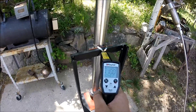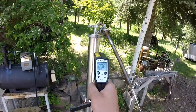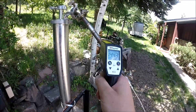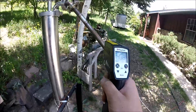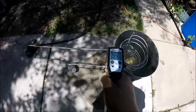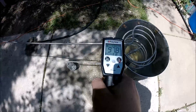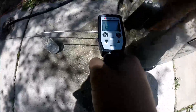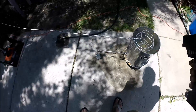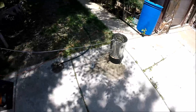About three feet up the column it's reading around 106°F, which is consistent — up top it's also about 106°F. The outlet tube is about 154°F, which is strange; it's a narrow tube so maybe it's holding heat better. The inlet to the condenser is roughly 100°F, and the outlet is about 82°F. So in reality the condenser isn't doing a whole lot — it's the tube going between the two stages that's actually taking a lot of heat, which is great.